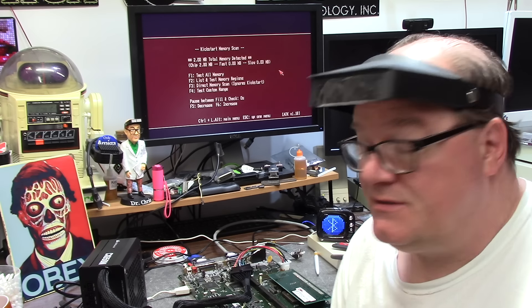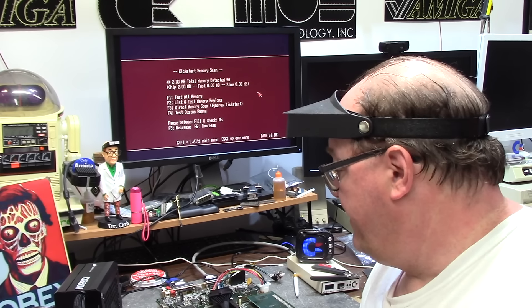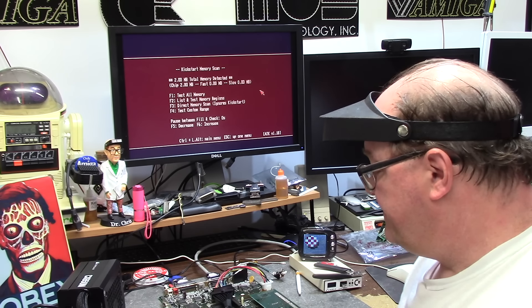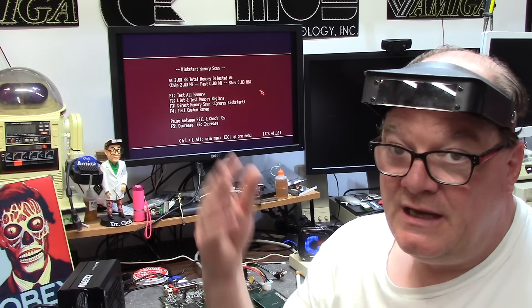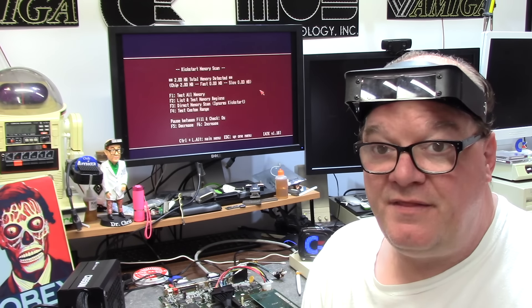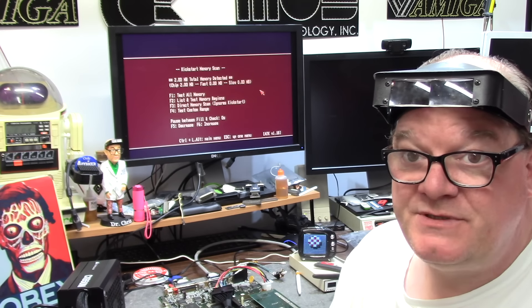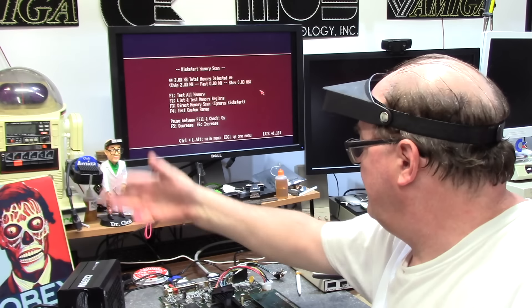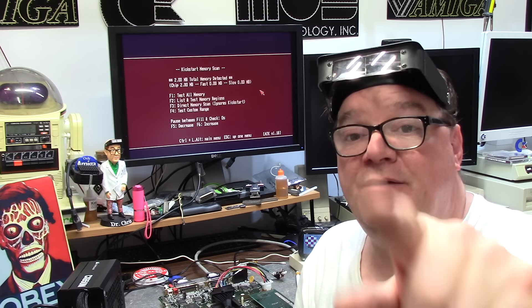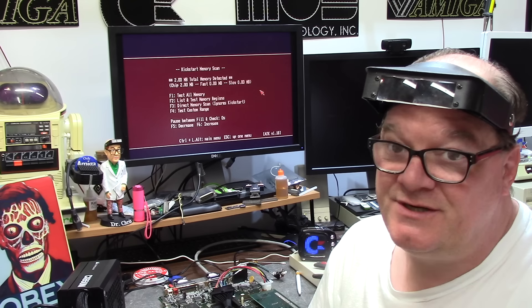All right — one socket, all the holes look good, this station really does a great job at total removal. Memory — two megs detected, okay great. At least you got a fresh op amp; you did tell me it was just a recap but you got a socket and op amp out of it too. The chip RAM was totally wasted and it kept falling out — now this is solid and we're back in action. It will need some RCA jacks in the future, but I'm sure the owner can do that — they're like 18 to 26 dollars shipped in America. Thank you guys for coming along on this journey. If you'd like to help me continue to do this, please consider joining my Patreon — it's only a dollar a month to start. 285 Amigas have been saved with your help. Until next time, thanks for watching and I hope you learned something.